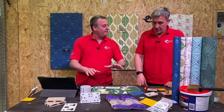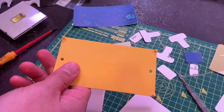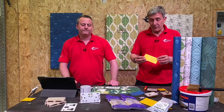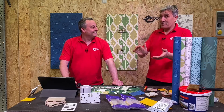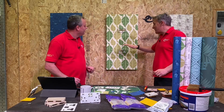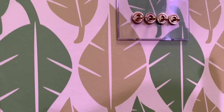When you take your time, go through the stages, and have the right kit - that sharp knife and cutting board were really crucial. Let's have a look at the remnants. We found the sharp scalpel, the cutting board, and the splates really useful - the splates aren't really meant for this purpose but getting that straight edge to identify the wallpaper made a big difference. The electrician needs to put the same level of care into making sure the back box is level - you really do want it spot on with the wallpaper, because the adjustable tabs in the back box won't help you here.